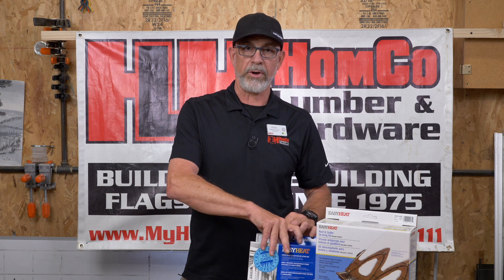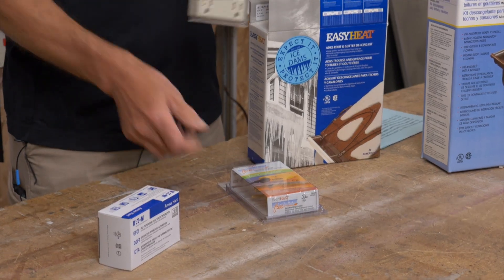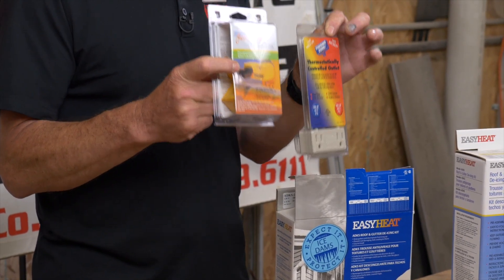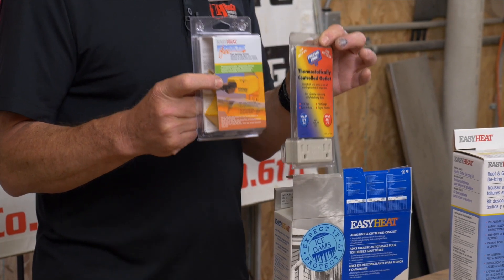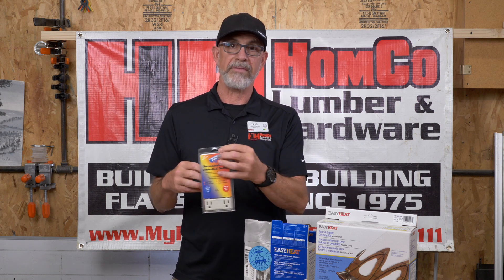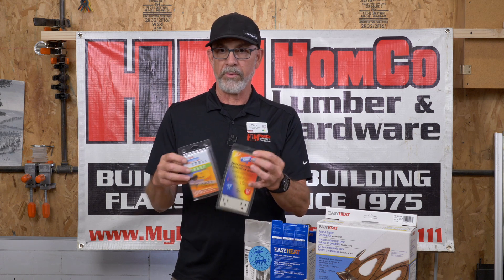Installation is very straightforward. You're going to need a dedicated circuit. You would use a thermostat — there are a couple of different options. Both of these are automatic; they come on at preset temperatures and go off at preset temperatures, so you're not using electricity when you don't need it. I would also suggest that you put a switch in line. It might be 32 degrees outside, but if we haven't had any snow it's January and you don't want this coming on when you don't need it on.